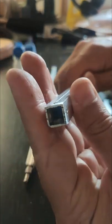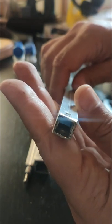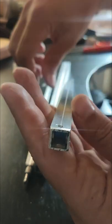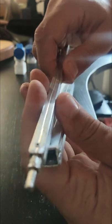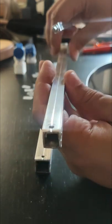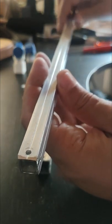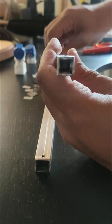Now we have all four of these little pads on the inside. Make sure they're as flush as possible. On the innermost segment, you'll notice I've filed the leading edge so that it will actually flush the pads towards the outside of the tube as it goes in. It doesn't always work, but you have to try because you want those pads seated correctly.